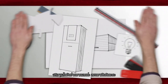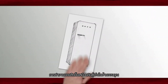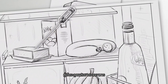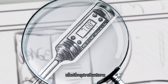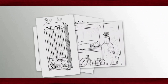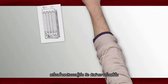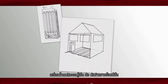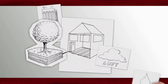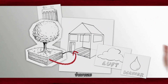This is actually quite simple. A heat pump works like the refrigerator in your kitchen, but in reverse. A fridge extracts heat from foods and transports the heat to the heat exchanger at the back of the fridge. Now imagine that the heat exchanger is underfloor heating, and the heat pump removes stored solar energy from the soil, the air, or the groundwater, and transmits it to the heating system in the house. So quite simple.